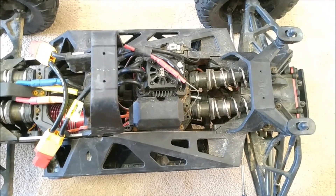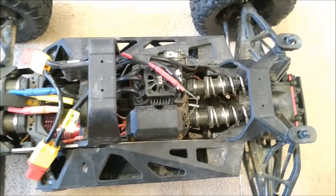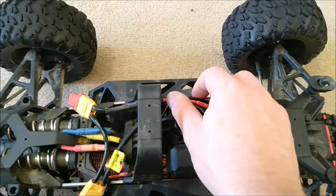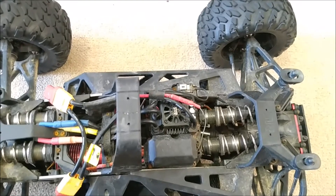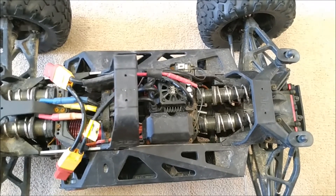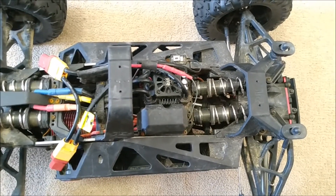I just didn't fully torque down the front two — I probably should have cut a notch out. The six-channel receiver has an antenna with some heat shrink on it, so I just tucked it under this piece here right up against the power wires. It's probably not ideal — there'll be some interference — but I've driven it like this a long ways away and it still works fine.